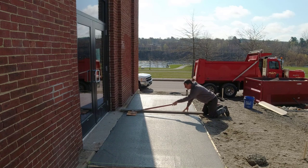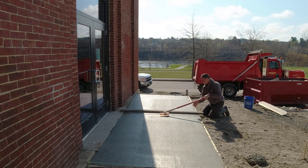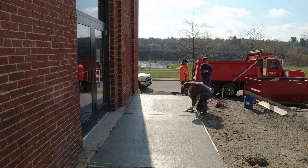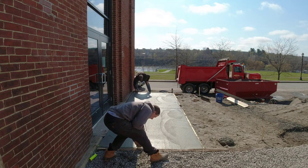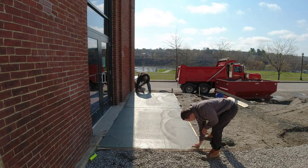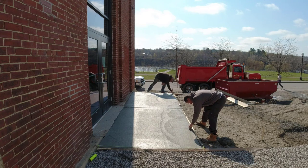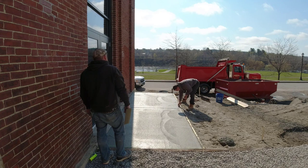This is one thing we didn't have way back when I first started in the 80s — we would have had to wait for the concrete to firm up enough to get on it, balance on that screed, get on hands and knees, and cut it in by hand, or get on it with some styrofoam and cut it in by hand afterwards. But nowadays with all these really cool tools you can get those joints cut in really early. I do like to wait for the concrete to firm up just a little bit before I do my edging though — I don't like to cut my edges in right after I get done bull floating. That's just a matter of preference and experience; depending on how much edging you have to do and how fast the concrete is setting up, that's going to dictate when you start edging.